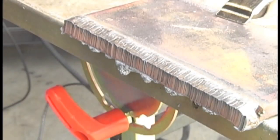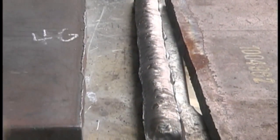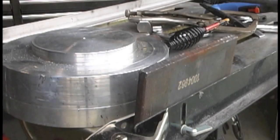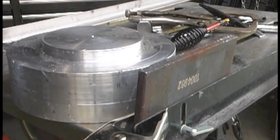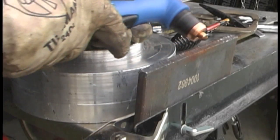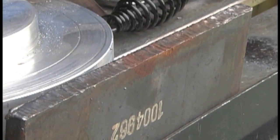But what about thick metal? What I've got here is three eighths inch thick plate that was welded. I used this in another video to do an overhead MIG. This would be a good way for schools to kind of help their budget out a little bit — students could learn how to use a plasma cutter, have a steady hand, and cut the welds out of plates like this and then reuse them at least once. Cut the weld out and then put a bevel on the plate and reuse it.